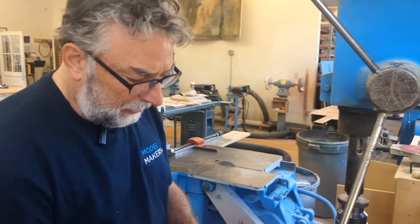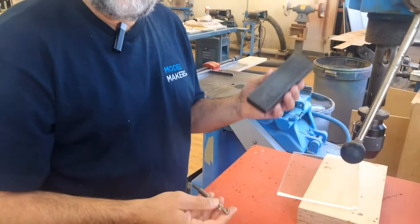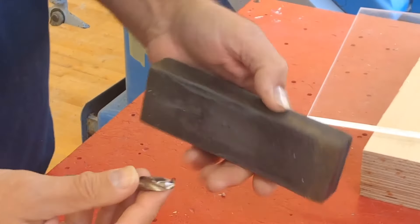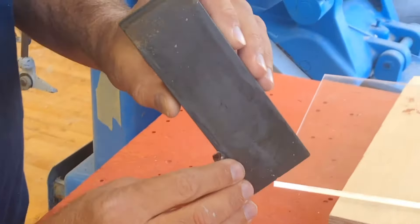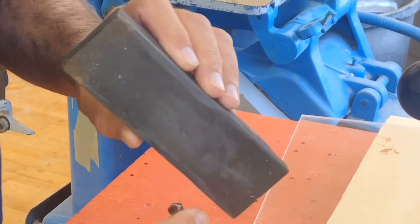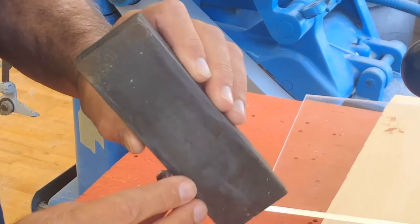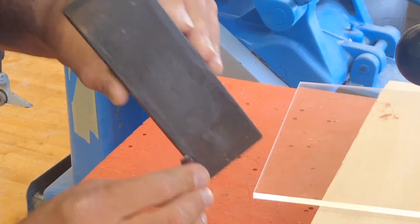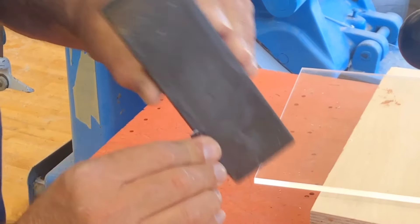What we do here is we modify our drill bits with an oilstone. We put a small flat on each cutting edge, and it's done very simply by running your oilstone parallel to the drill shank and just breaking the sharp edge.